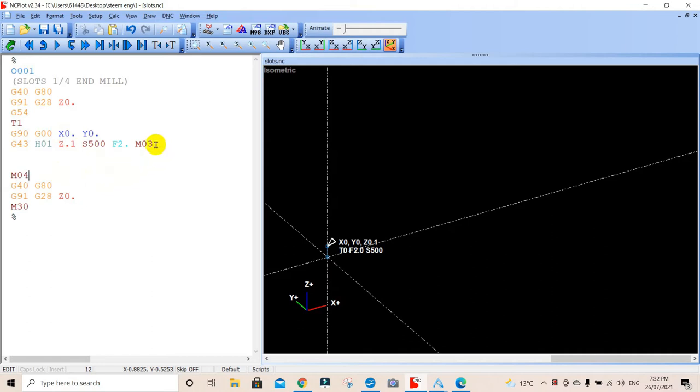And actually, the last program, I think I forgot to retract the circular interpolation, the pocket milling of that one there. I forgot to put that back, feed that down to the top surface there. It was still 100 thou up and hadn't rapided down. But that's something you'd find out if you were programming anyway, because you'd see it on the job.